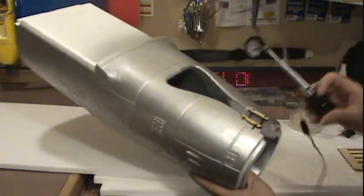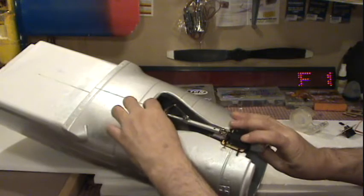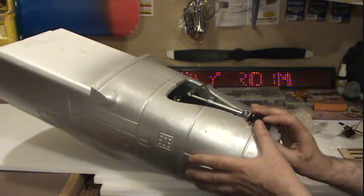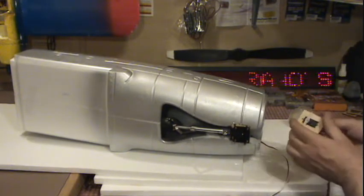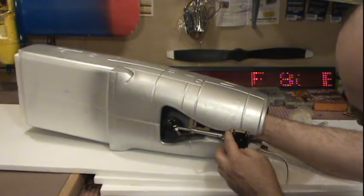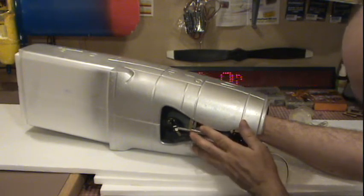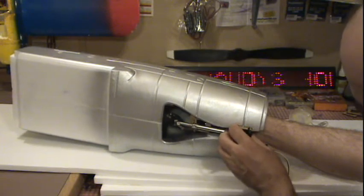So I'm going to carve the wood out with the Dremel. And I'm going to get this mounted in here, screwed on. And I have to cut this little bit out here. Now, after I get that screwed on, this here has to go inside and up under just the right height under here so it misses that landing gear. And then the cables from here to here, but that length has to be determined by the landing gear being out because the steering goes loose when the landing gear comes up. So the servo will still turn with the rudder. It won't make the wheel turn inside here.